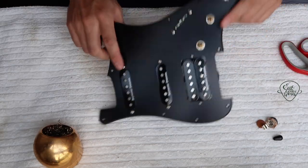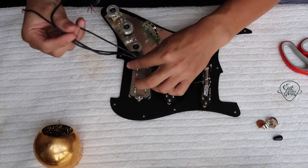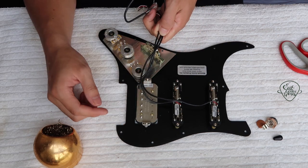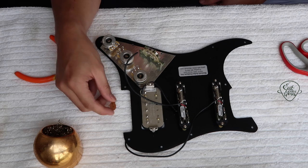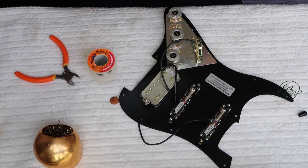So the next step is to wire them up. I'm going to be cutting the wires — I don't want to leave a mess inside here. Just measure these guys up; I give them about two centimeters of excess. The capacitor I'm using is 0.1, so I'm just trying it out, not sure if I like it or not. Get some of these wires.